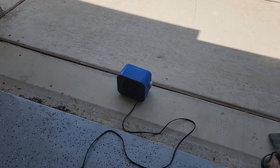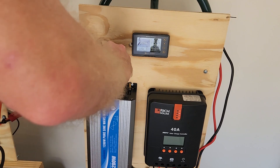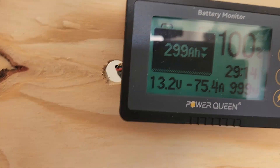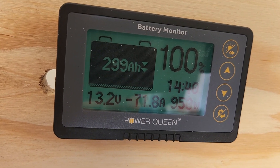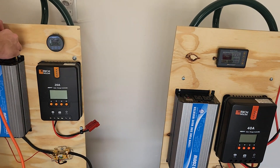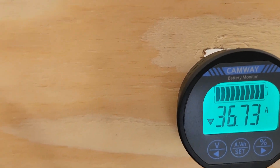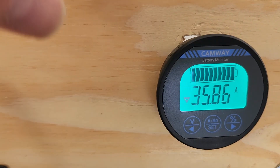I've got my little $20 space heater aiming out into the garage because it's 100 degrees right now. Let's plug it in and see what the current draw is. At a thousand watts on my 12-volt system, I'm pulling 75 amps. And I'm pulling exactly half that on my 24-volt — exact same load, exact same device, and I'm only pulling 36 amps. That's much, much more reasonable.